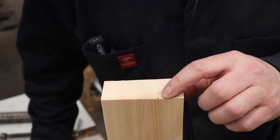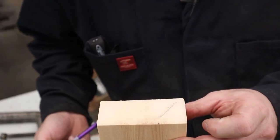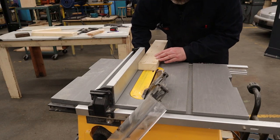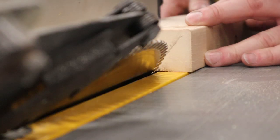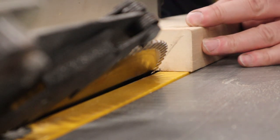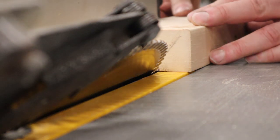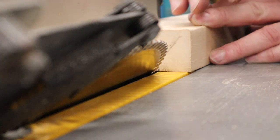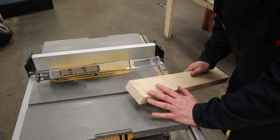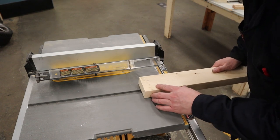There we go. This mark is what we're going to line up with our angled saw blade on the edge where it will cut, then take a cut and see what it looks like. Take your material, stick it against the fence, unlock the fence, and start moving it over so that the edge of the tooth on this side is cutting through that line. That looks about right — I'll lock that down. Before I start — and you won't be able to hear me over the saw — I'm going to put the material against the fence and start the cut until the blade has come up through the top.